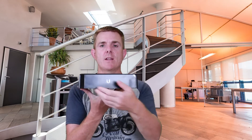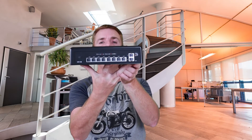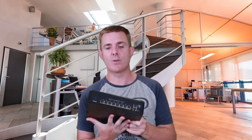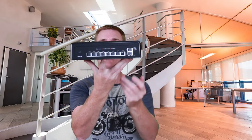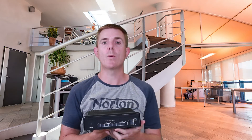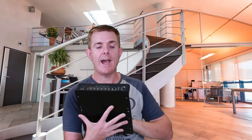On the front, let me just take the cover off. The first time we opened this up, I thought we'd ordered an SFP switch because they all looked like SFPs to us. They are actually the dust covers for each of the RJ45 connectors, each of the Ethernet connectors. You have eight ports along the bottom — these are PoE++, so they support up to 60 watts of output per port, and the whole unit will support 430 watts of power, so a pretty hefty output.